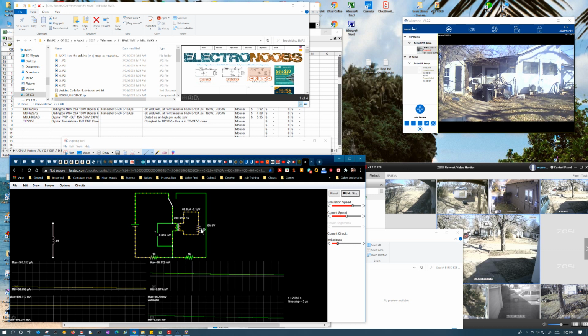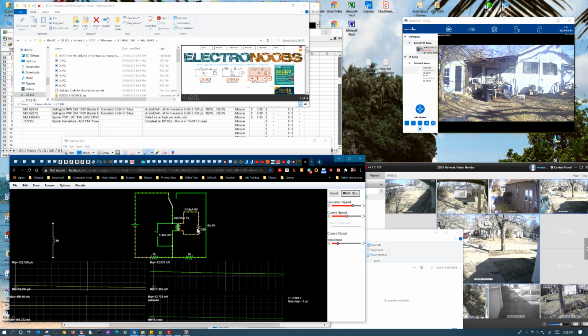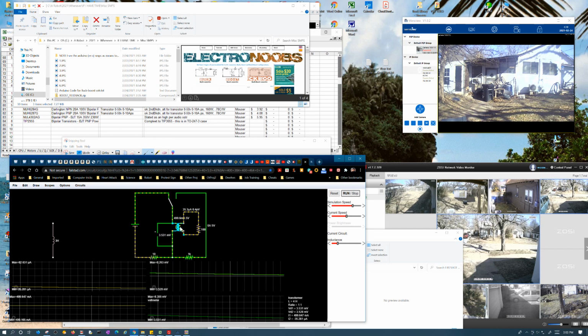It's actually extracting that initial amount of energy. It's taking that same amount of energy and spreading it out, is what it's really doing. I think that's exactly what it's doing. That's why I said it looked like the first part of this curve had been cut off and then inverted, because it actually has. It's taken that amount of energy out of the system, stuck it into the magnetic field very quickly, and it's basically discharging through that resistor as we go.